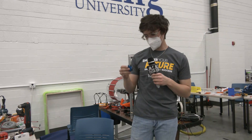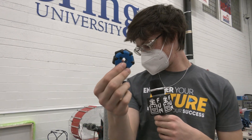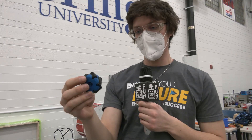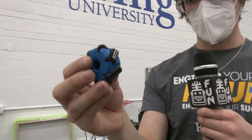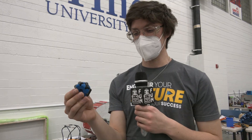First off we have the ThriftyBot two-inch mecanum wheels. We tried these out — they did not make it to the final robot as of yet, though we could see changes. We used them for testing on the cargo, seeing how they would react to trying to collect. Overall they did a pretty good job. We liked how they acted when vectoring in the intake wheels and getting better, positive control of the cargo. We don't have a wild implementation for right now, but we really liked how it reacted. In a more controlled environment with the exact compression down pat, if we had more than three days we would definitely want to implement these in the long run.